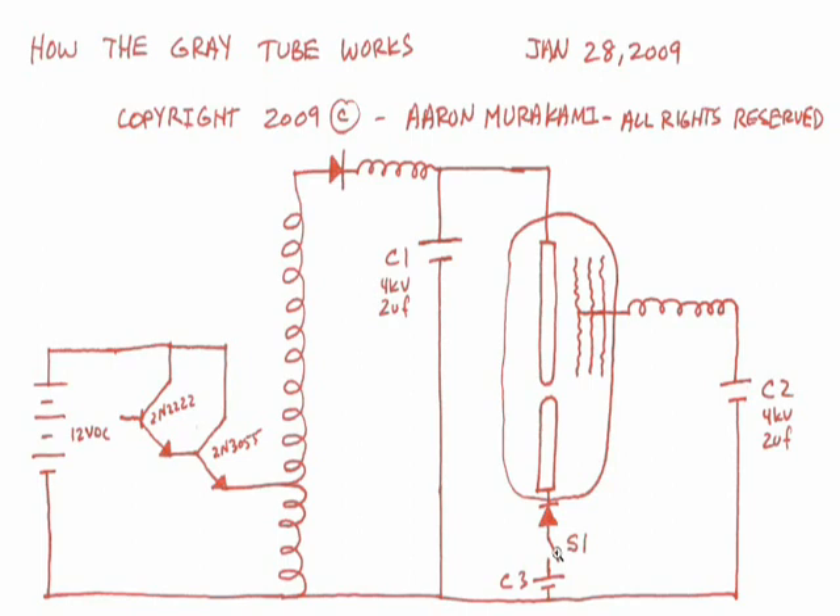When these caps are charged, closing S1 through a commutator or whatever triggers the event. As soon as you close S1, this capacitor discharges through this coil, smashes into the high-voltage potential of capacitor one's positive potential, and the only place for it to go to ground is basically this diode — backwards through the diode. This can be a capacitor or battery, but if you use a battery it might explode it, so the capacitor is safer. When this diode shuts off, it causes this discharge even quicker. You get the plasma ignition system burst effect up at the high-voltage rod, and it's a greenish-white color. I don't believe the copper is the source of the green because I get a pure white plasma burst from the copper rods, and then I get the charging from the ignition coil from the high-voltage rod to the grids, which is like a blue spark. So it's distinctly different — very, very green. That's the event, and it does charge this coil.